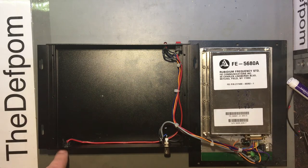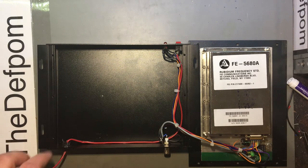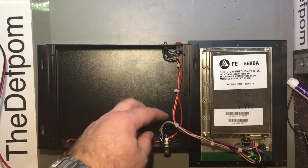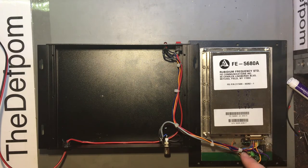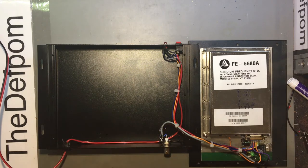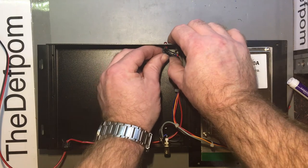It's built now. I used a cable gland on the back — I drilled the hole and crimped one of those cable glands in there. Since I didn't have any 2.1mm chassis jacks, I've got a twin-core cable coming in for 12 to 15 volts. There's a BNC jack on the back with shielded coax running up to the rubidium. I've taken the original LED wire off the plug socket and run a new wire on the same color so I know which is which. Both LEDs are wired up to the front panel.